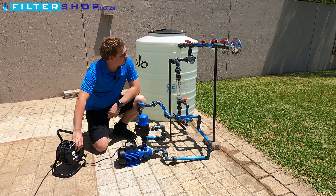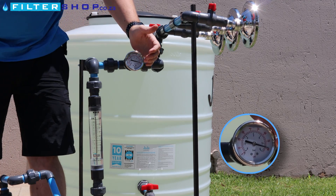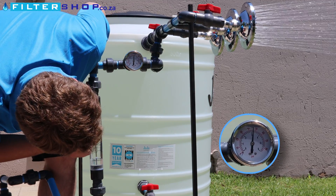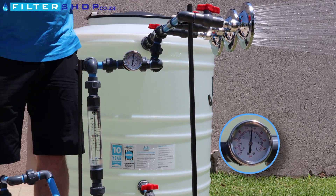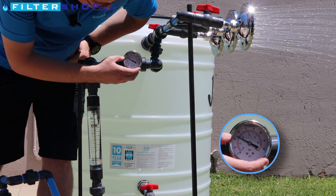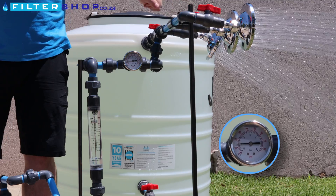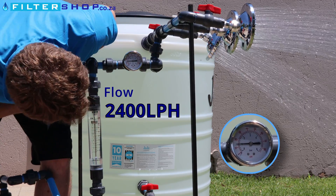Let's see what we actually find. Turn it on — everything is closed at the moment. On our pressure gauge here we're finding five and a half bar pressure. If we then open one shower, one shower fully open, we're sitting at about 21 liters per minute and our pressure has dropped to about 3.2 bar. If we then open a second shower, the pressure dips further — down to about 1.6 bar, and we're sitting at about 35 liters per minute. And then if we open a third shower, there's a significant drop in flow rate, and we've dropped down to 1 bar, sitting at probably about 40 liters per minute.